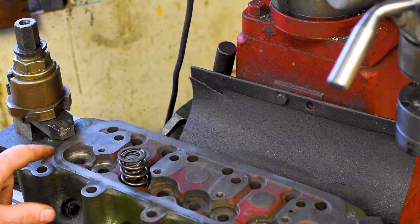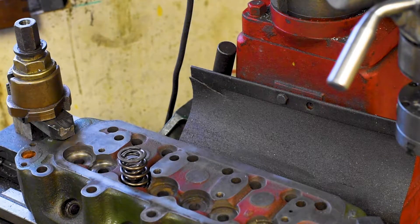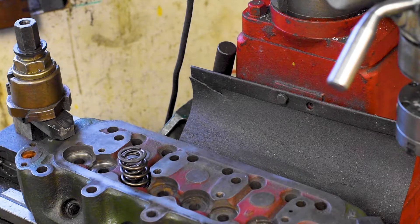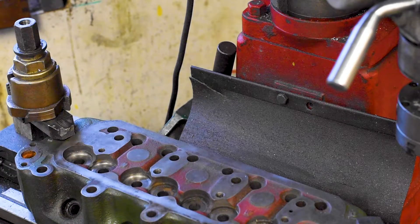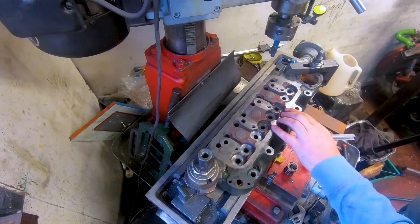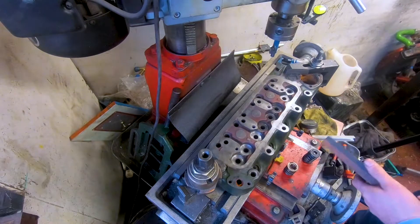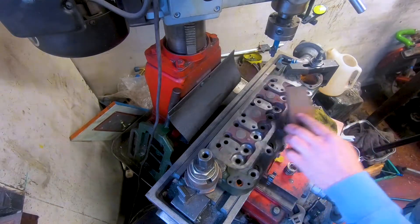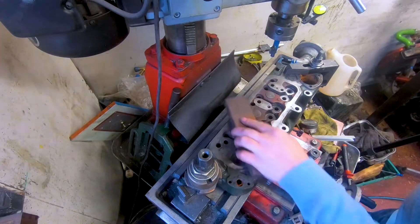What I want to do is accurately set the distance between the surface of the cylinder head and the top of this valve spring seat, and set it as closely as possible across all seats on this cylinder head. The first step is doing some measuring. But before that, it's important to make sure we have a flat surface. This is a machined surface, machined in the factory very similar to these valve guides, but it has had some years on an engine. So just to make sure we don't have any bits of junk or corrosion, we're going to run a stone across this cylinder head.